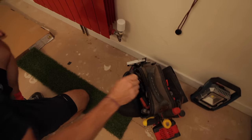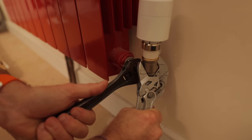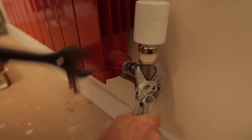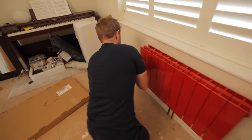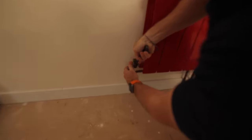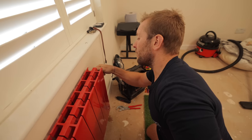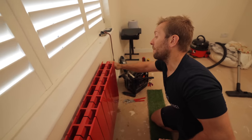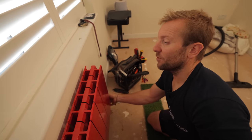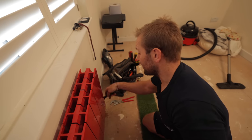Once you've drained, come back in. First, just lightly slacken off the valve and see if you've got any water remaining in here. If you want to get it out quickly, let that off and it'll come flooding out. Then lift the radiator off the brackets like so and fold it down.